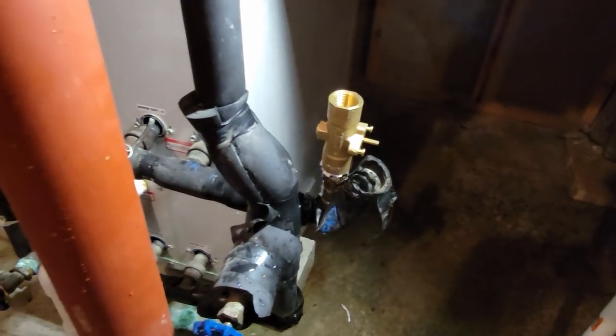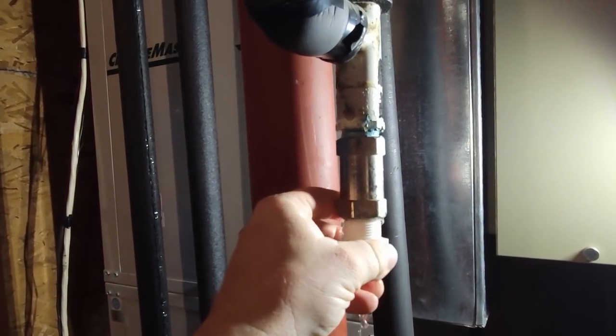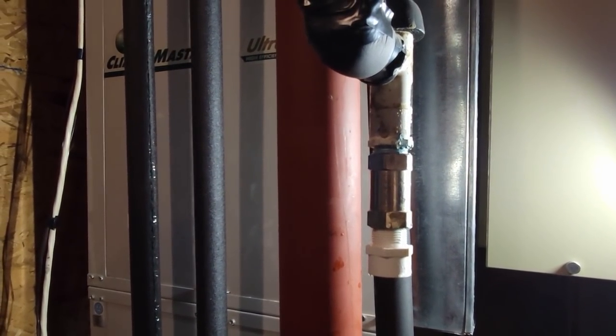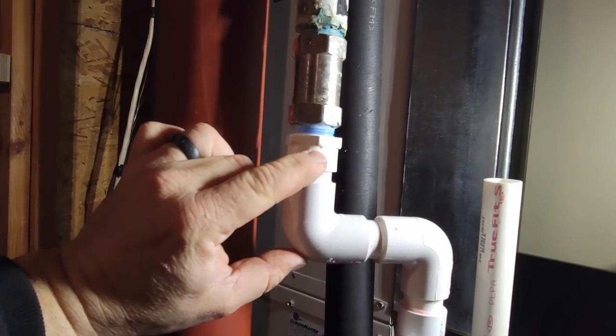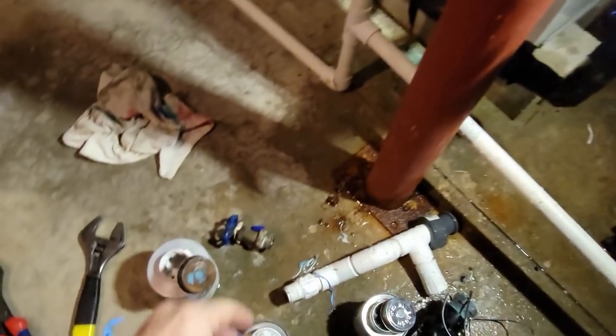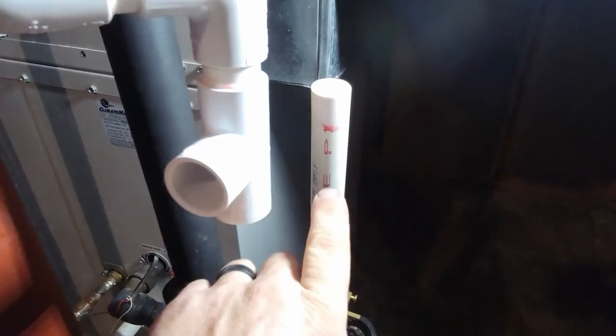You are able to pull this little pin there from that piece - you really can't do this wrong, it's a ball valve. Depending on how you want the head to fit on there. We've got it in there - I'm going to leave the head so it faces over here so you can kind of see it. Then I usually go with the threads and wipe off any excess dope. Probably just going to use some 90s since we've got a load of 90s all here and there, and it's not that restrictive. That little silver thing there is a flow restrictor - it only lets a certain amount of gallons per minute through. You only need about one and a half gallons per ton on an open loop system like this so you're not moving any more water than needed. We've been doubling up with the tape and dope, pretty much lining it up and got the T back in there again so we can flush it.